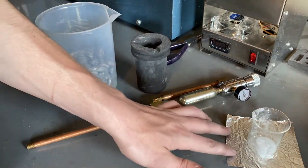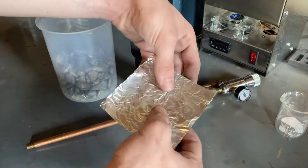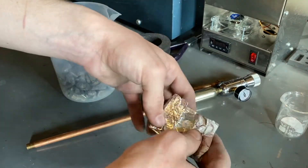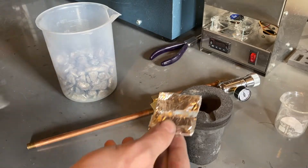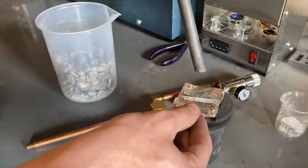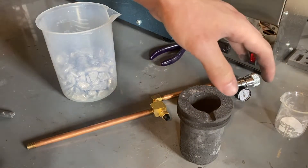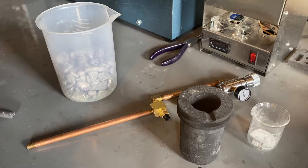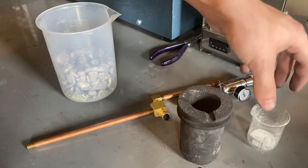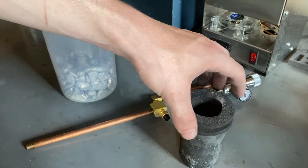The way I've gone about doing that in the past is by using sodium bicarbonate, or baking soda. I would use some aluminum foil, fold it into a pouch, fill it up with baking soda, then use my graphite stirring rod to push the pouch all the way to the bottom of the molten aluminum. The aluminum foil would melt, the baking soda would dissolve, and CO2 gas would bubble up through the surface. It worked pretty well, and my casting results became tremendously better.